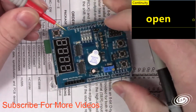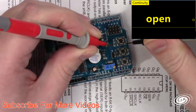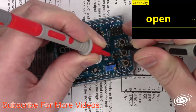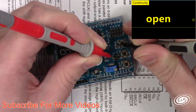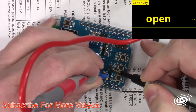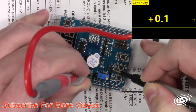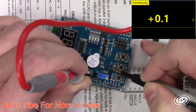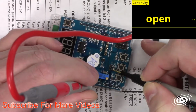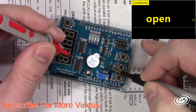So what I'm going to do is, I want to go from that to that resistor, so that goes to that. So I want to pull that off. I want to find out where this jumper goes. So it goes to this transistor and the other side of this capacitor. So is that just tied into a ground plane? No, it's not tied into a ground plane. So it has to be going to power this buzzer.